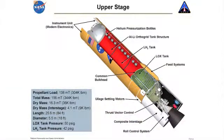Moving on to the upper stage, this is the one being developed in-house by Marshall. It's LOX hydrogen and uses the common bulkhead — a carryover that was used on the S2 and S4B stages during the Apollo program, a very efficient design. It has a single J2X on it. The LOX is in the back and in the front; the red is the fuel — the liquid hydrogen. The little bottles inside are liquid helium used to pressurize the LOX tank. We store them in the hydrogen tank because it's colder, run them through a heat exchanger on the engine, and that's how we pressurize the LOX tank.